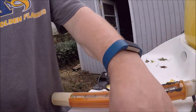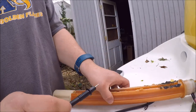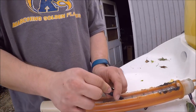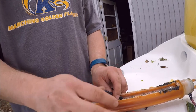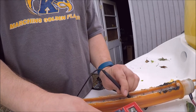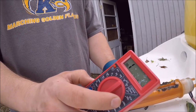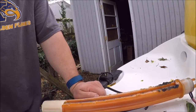You can do that in reverse also and test. Put your positive in and now check your negatives — make sure you're going on the negatives. This is about halfway up the board, making a 68 reading. We're back on the magnetic piece, getting 58.3. Just keep going about that and see what you can find. If something's blown out, you might need to re-solder it.